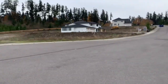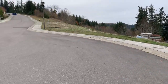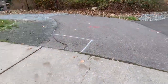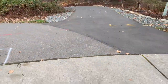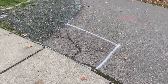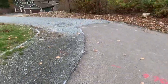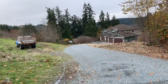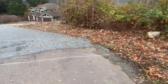Coming down the hill, you can see we've got room here for staging at the top of the hill. I've sprayed in where we need to saw cut. We're going to leave the existing asphalt here so it doesn't interfere with the neighbor. Saw cut that crack out, and we're going out 18 feet all the way down until we get past this greenhouse. There's a light pole down there, and it'll transition down to 12 feet wide, but this section is 18 feet.